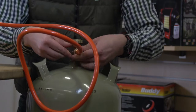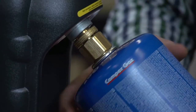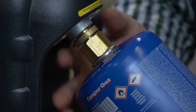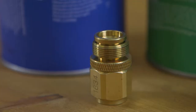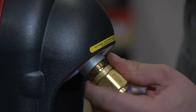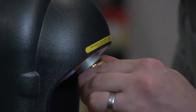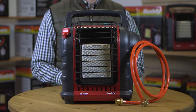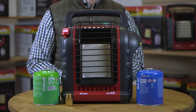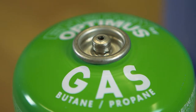Your Portable Buddy Heater is designed for use with propane gas cylinders as well as threaded gas cartridges such as Primus Power Gas and other 70-30 type blends. Be sure to only use the gas adapter on CE-certified buddy heaters and not on buddy heaters certified and sold in the US. Your CE-certified portable buddy heater was specifically designed for use in the European market and for use with propane as well as propane butane-blended fuels.